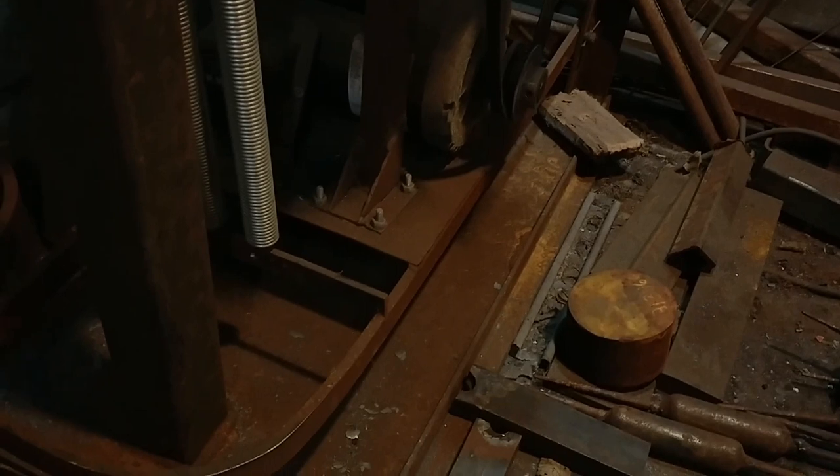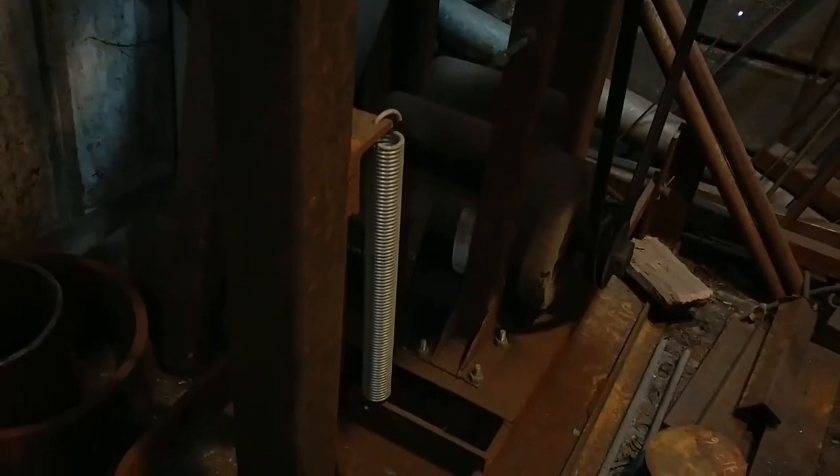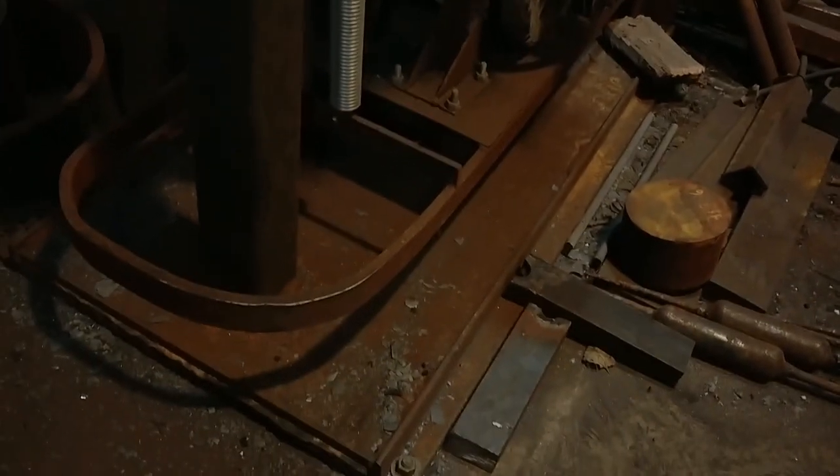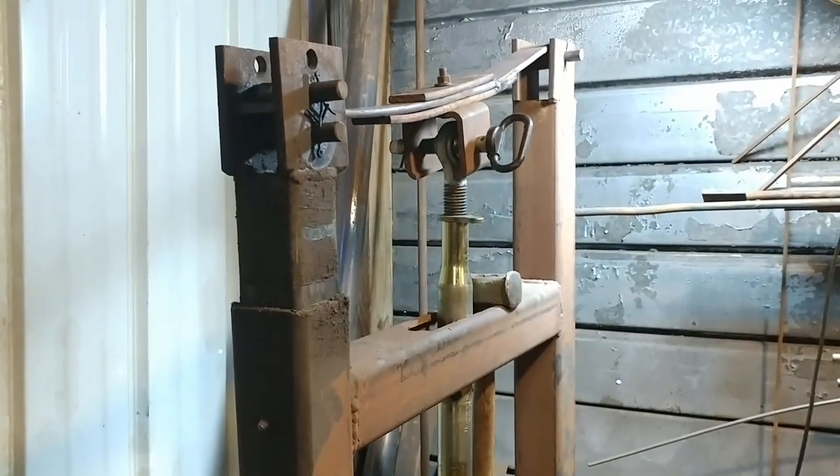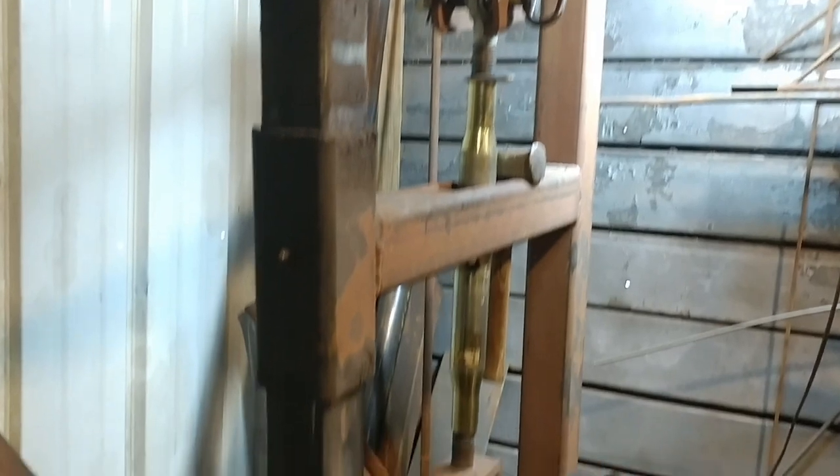If you get it a little off to one side or the other it'll obviously have a bit of a wobble, but it's going to do that anyway with the hammer running. That goes down to my motor and my brake. The brake is just a very simple tractor supply mat bolted to some angle iron. There are two little height adjustment bolts. The motor — you've all seen an electric motor — is hooked up to my foot treadle with a spring return. You just press the treadle, it releases the brake and tightens the belt, which then allows the hammer to run. Pretty simple in operation.